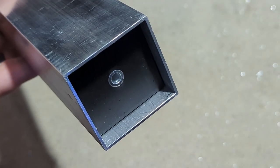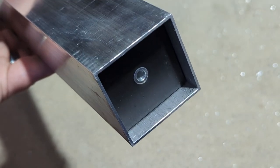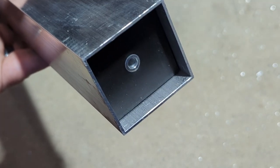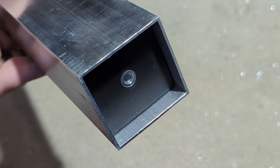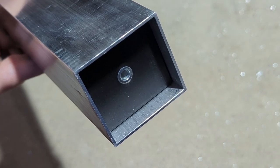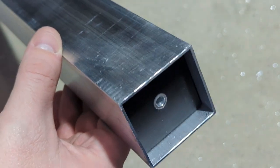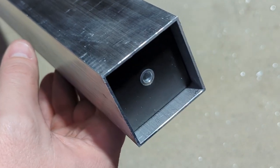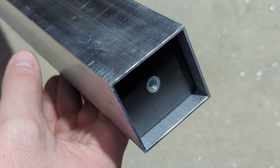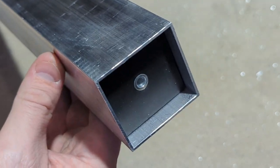One thing to consider prior to assembling all of this is the length of your stages. We're looking at the 2x2 base stage with the 1.5 stage inserted in it right now, collapsed completely. Because I left the stages equal, in this example they're all 2 foot long. It only gave us a little over 3/8 of an inch left of space when it was fully collapsed.